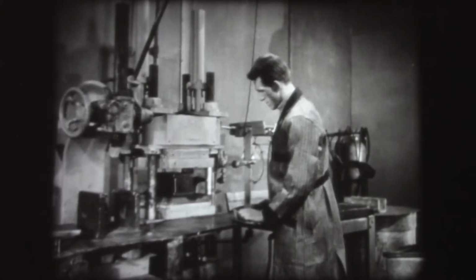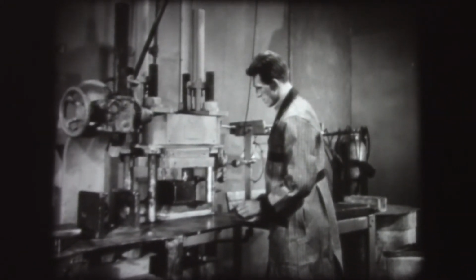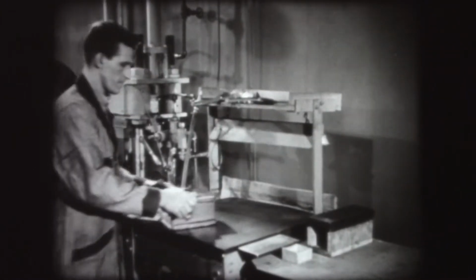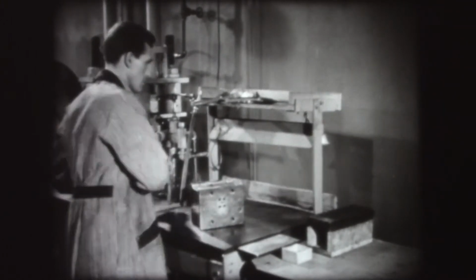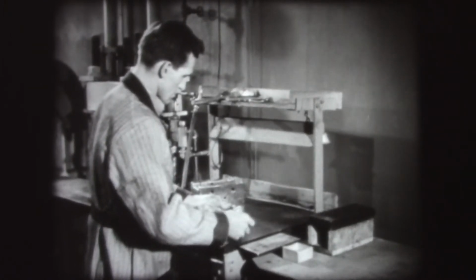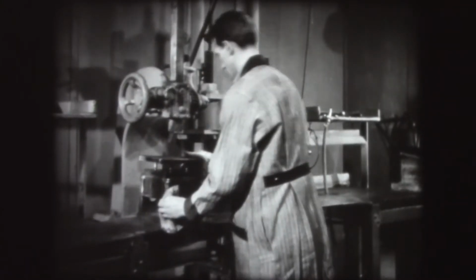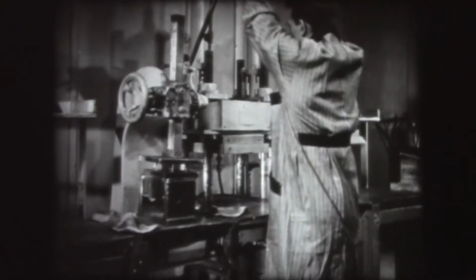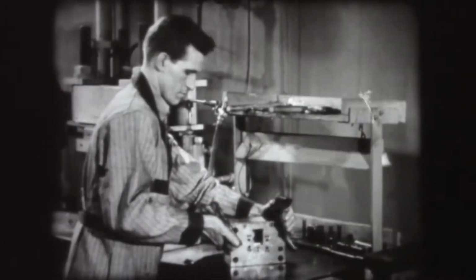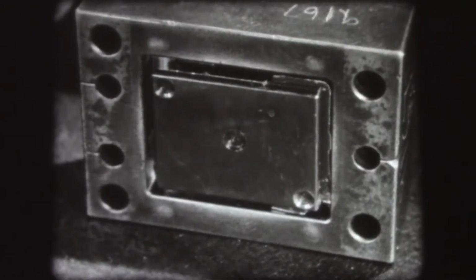A hand mold is generally used to mold such a part. A hand mold is also used for small runs. The entire mold comes out of the press after each cycle. The disassembling and assembling is done on a steam table to keep the mold hot for the next cycle. An arbor press is used in the disassembling procedure. Finally, the piece can be tapped out of the mold cavity.